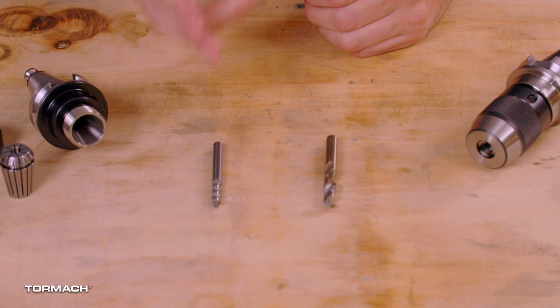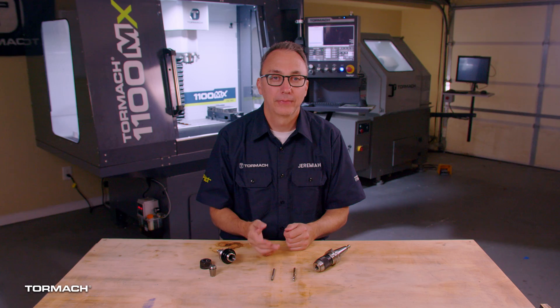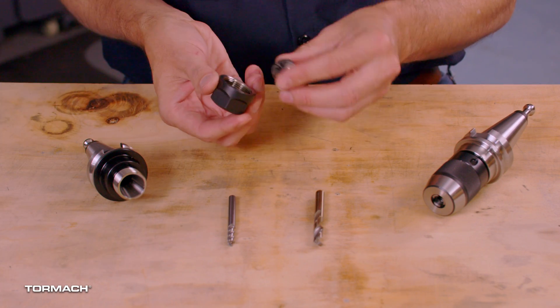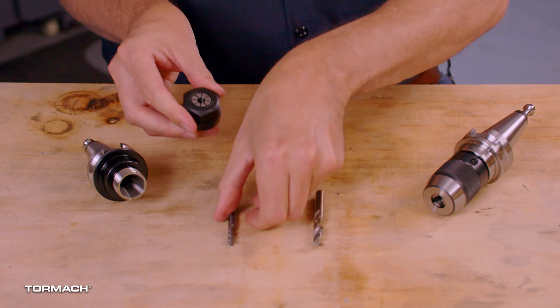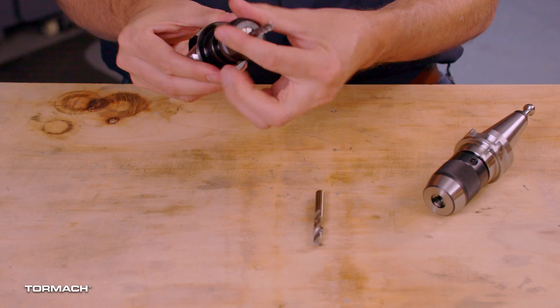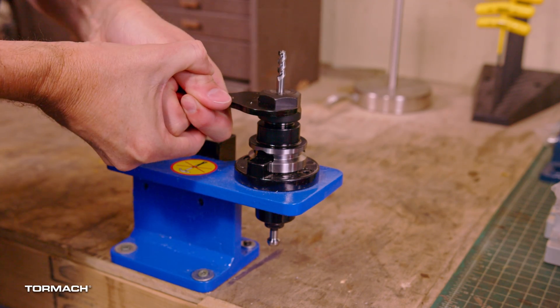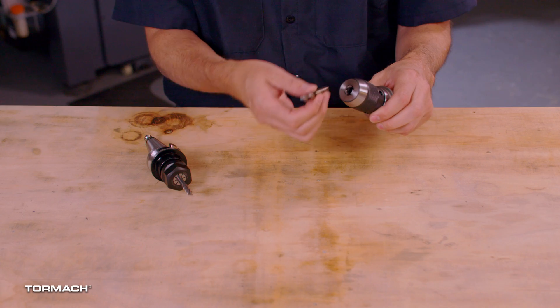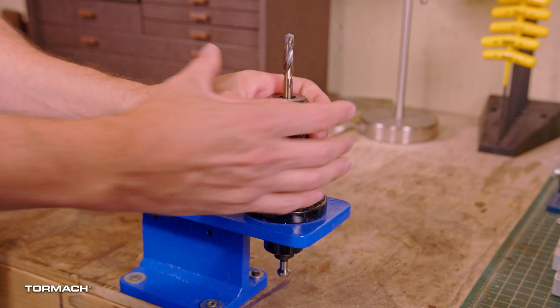That's just a brief overview of tooling and tool holding. Let's get to preparing your tools. For your first part, we'll keep it simple — let's use a drill bit and an end mill. Select a 3-flute quarter inch end mill; that'll work great for aluminum. Next you'll need a quarter inch collet. To install a tool into a collet, first snap the collet into the cap, then insert the tool, and screw the cap into the tool holder and tighten it down. Next, take your 5/16 inch drill bit, insert it into the chuck, and tighten it down.